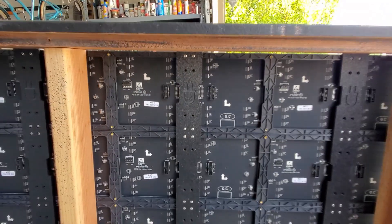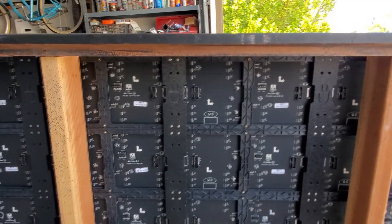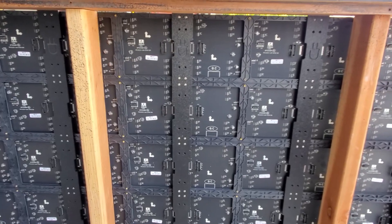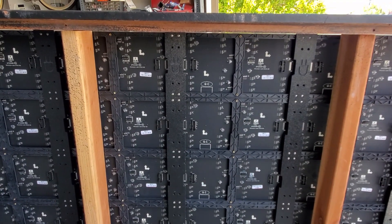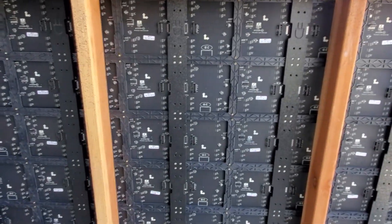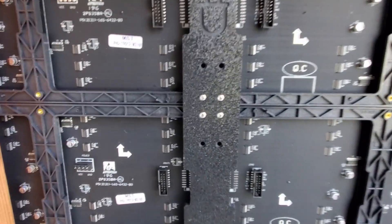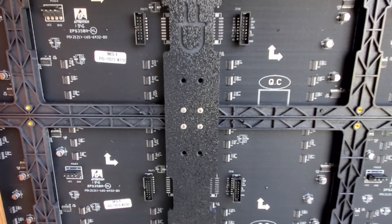If you're going to buy these mounting brackets — these came from Wired Watts — Kim was great at consulting with me on the phone, saying 'Hey, have you measured your panels?' The panels I have here I bought from Wally's Lights. Not all panels are the same, so you want to measure the distance of the holes to make sure they fit.